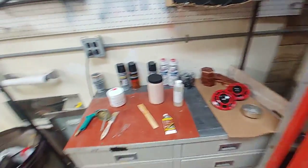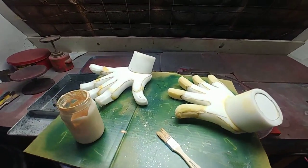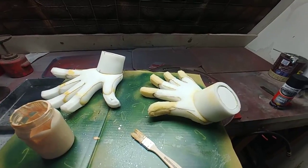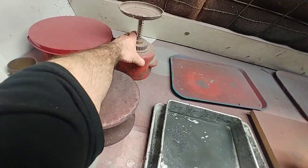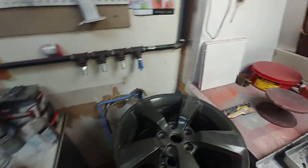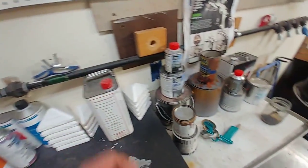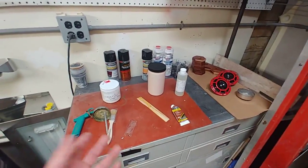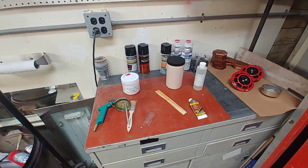With the rigid variant, you can dwell it and quickly remove it from the mold before it fully cures for a heavy-duty rubber casting. If you want to foam-fabricate something stiff, the rigid Creature Cast can go right onto rigid foams too — urethane or styrene foam — since it's water-based. You can brush or spray it on and get a nice hard shell that still has some give, similar to polypropylene or other tough production plastics.